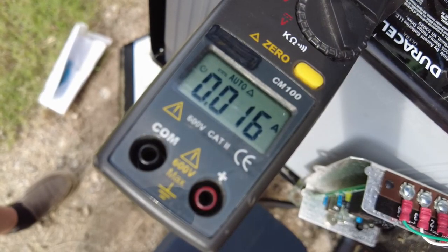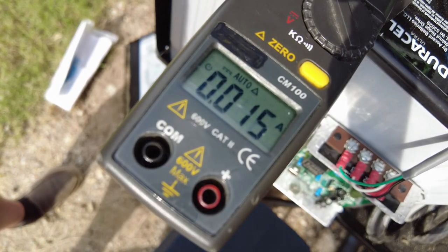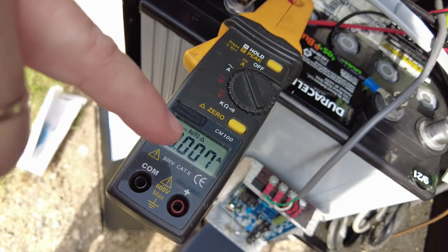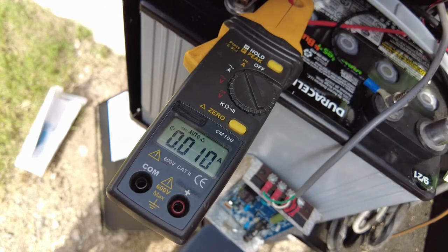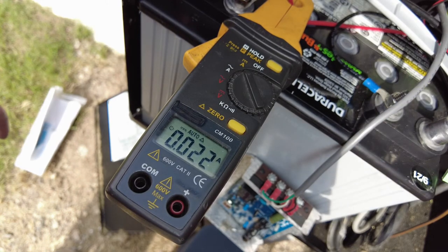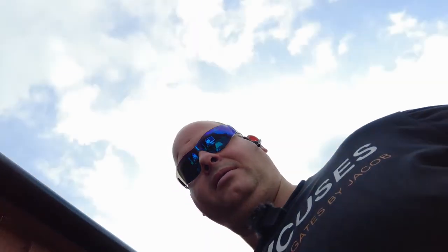This is the nice 1050 board on its own in standby or solar sleep mode. I'm going to pause the video while I rewire the new receiver in place of the old receiver and then come right back. Now we have the new radio receiver wired up in place. The board's amperage draw has actually decreased a little bit while I was doing that, but that's minor. Now we're going to plug in the new radio receiver and see what the amperage draw pops up to. Minimal — not even 20 milliamps. We were definitely dealing with a bad radio receiver out here.